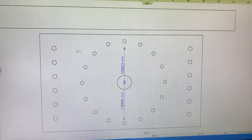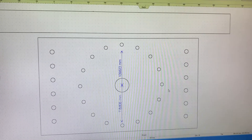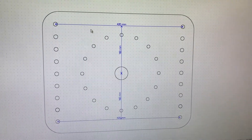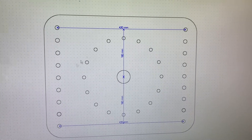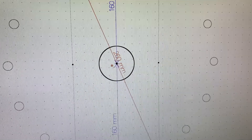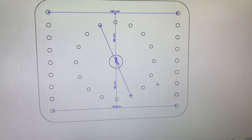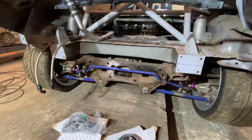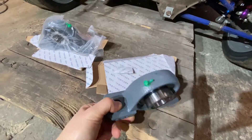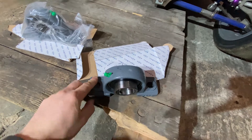This is basically the shape now — we've got a 300 by 500mm square, and the lockout wheel, which was going to be separate, is now incorporated. The hole centers are about 100mm in each direction. So it's 400 by 500mm, with a 50mm radius around the outside to make it look a bit prettier. There's a 300mm circle and the hole centers on the circles are 260mm. There are 16 holes set 40mm apart, giving us a decent height range of 160mm in each direction. The bearings have just arrived — they turned out to be self-aligning bearings, at about £17 each, so not exactly breaking the bank.